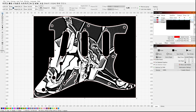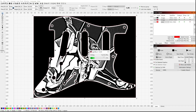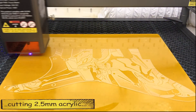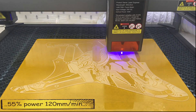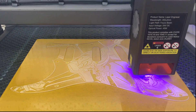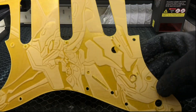If you forget to turn off air assist, you'll end up cleaning your cotton candy machine. The ultra-fast engraving speed of 25,000 millimeters per minute is impressive. The cutting power for 2.5-millimeter acrylic at an extreme slow speed of 120 millimeters per minute is 55%, with air assist turned off. When engraving acrylic, it is best to remove the plastic protective film on the engraving side and keep it on the other side. For cutting, it doesn't matter.